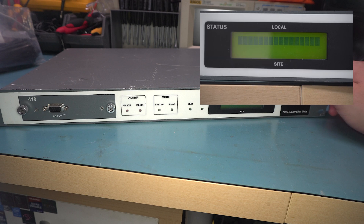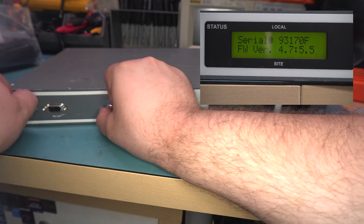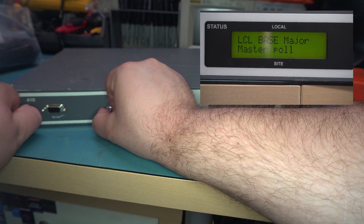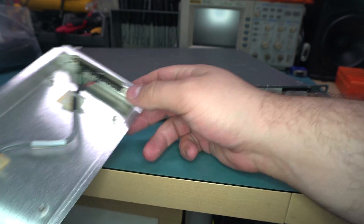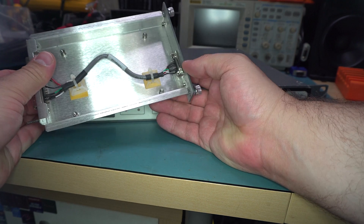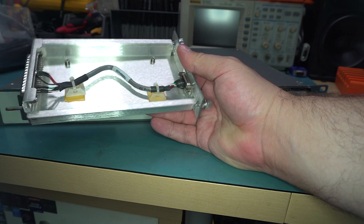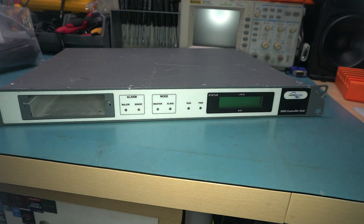The LCD just shows some kind of boot sequence stuff and never really does anything. On the front there's an RS-232 port and it's actually a removable module. I was thinking this was like some kind of upgrade card — a plug-in option of some type. But it turns out it's literally just a wire that connects to a much larger DB connector at the back. This is clearly designed for other upgrades; you can even see spot screw mountings for a PCB. But it's just putting out RS-232 anyway, so it just needs a passive wire connector.